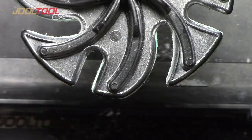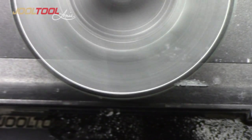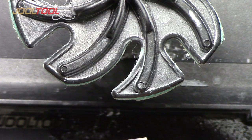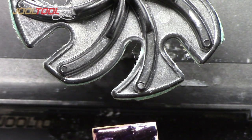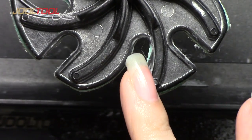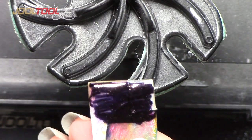Let's get started with the coarse — I'm going to run this at high speed with a little water. Remember, you don't have to saturate it with lots of water because the water is used as a lubricant, not as a coolant. The patented disc will create enough airflow and allow heat to escape, so you don't have to worry about the heat aspect of grinding.